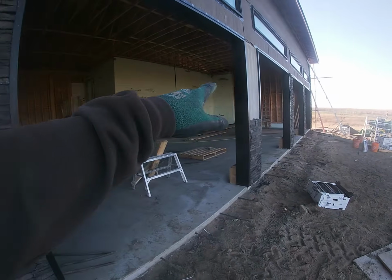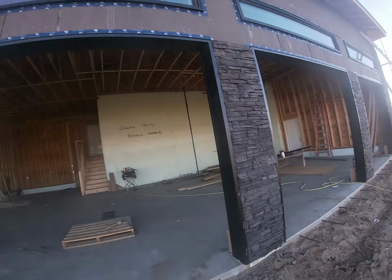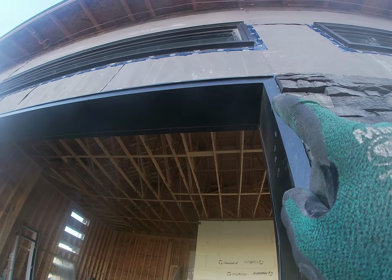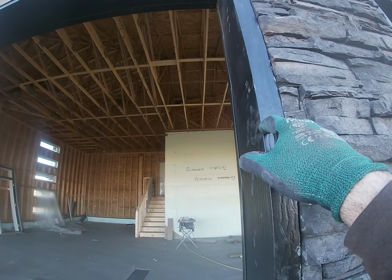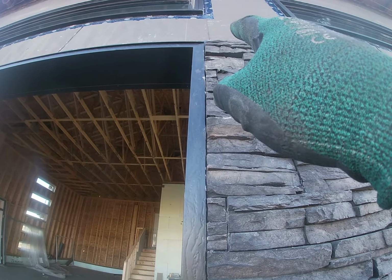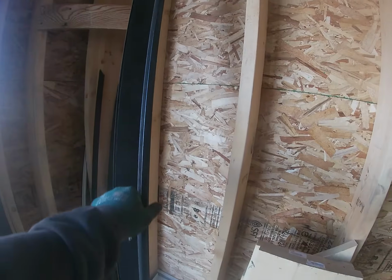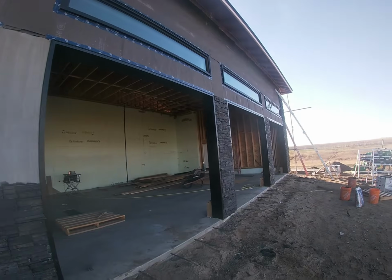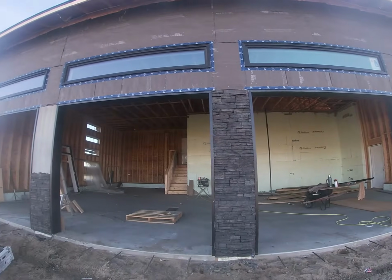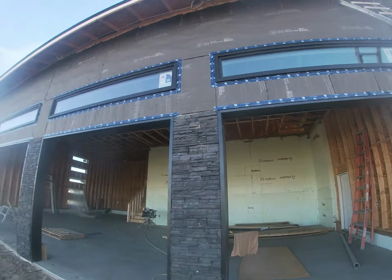So all I've got left today is this little piece. I just ran out of daylight yesterday. And then I was thinking yesterday that over top of the doors we've got that drip edge there. It's that flashing that goes up behind that tar paper and then wraps over top of the door. So any rain that gets in there can't go behind the door. I'm thinking we should have the same thing on top of this brick, but it's got to sit out a little bit further. So I've got this other stuff here. I'm hoping it's going to work. This was ordered for the door, but it ended up being a little bit short. It actually matches this stuff. It's got this texture on it, but it ended up being just a few inches short for whatever reason. Tom had this stuff with him, so we just used his stuff and called it a day. So I'm thinking that should go above those there, so I'm going to do that today.